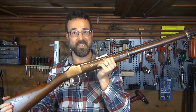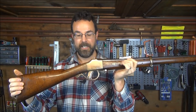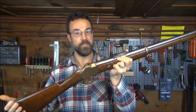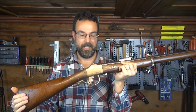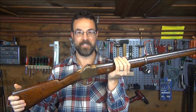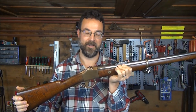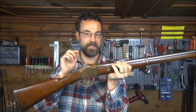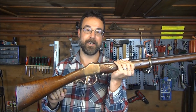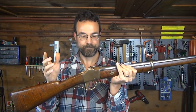and weighs a ton. Now this weighs obviously more than it should because it's made of phosphor bronze, and the idea was initially that this would be wonderful because it's great to machine, which is good, but in fact it was a bit of a false economy. It is a bit softer than steel, obviously not a real problem for the black powder cartridges of the time, but there is something that occurs with these that I'll show you later. Anyway, they quickly realised the problem, and after about 8,500 of these, they changed to steel.